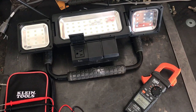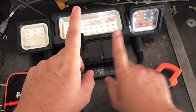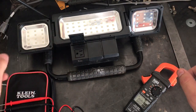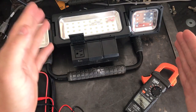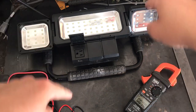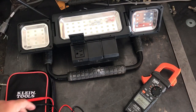Your half-phase power is only one pole of your power circuit. The power coming into your house has two hots and a ground. Both hots are out of phase with each other — one is 180 degrees this way and one is 180 degrees that way, meaning they go in opposite directions. When one is on, the other is off — that's alternating current.